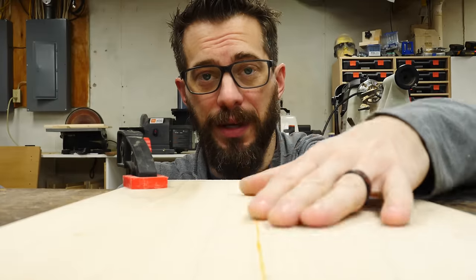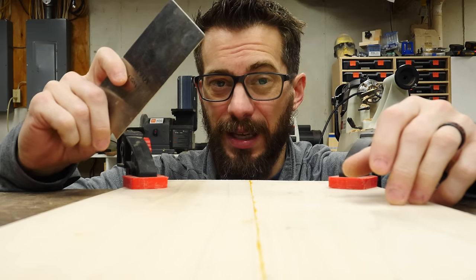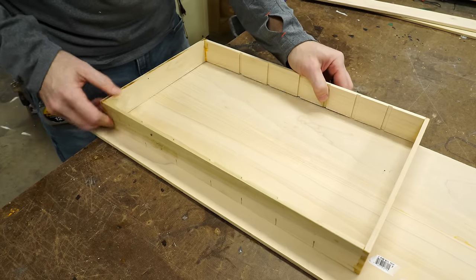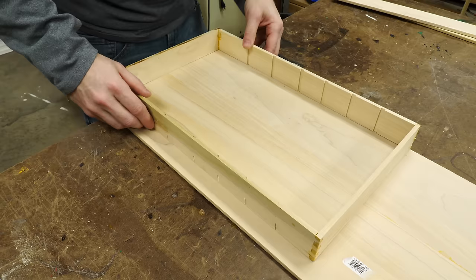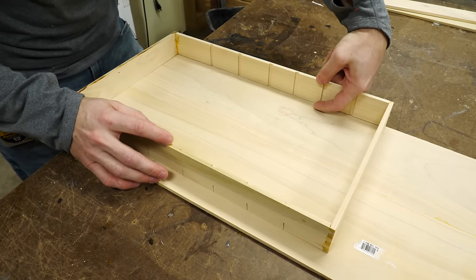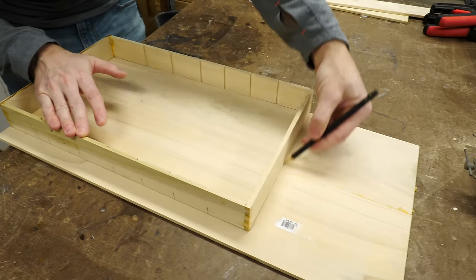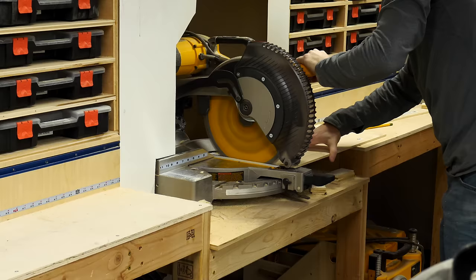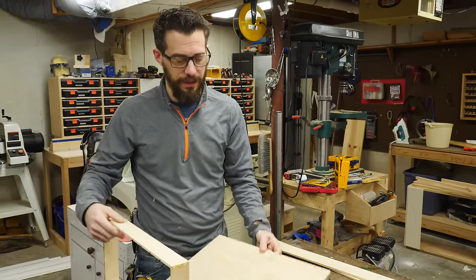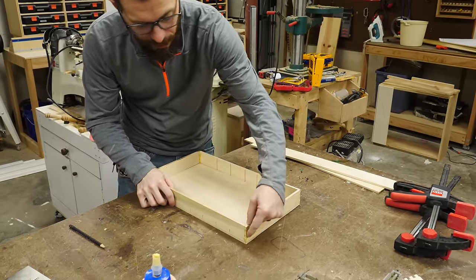If you've got a glue line you need to get rid of on a panel, you can use a big paint scraper, a sander, or a card scraper. The card scraper is something I've only recently started using and it's really handy with not a whole lot of dust. Now I'm just going to lay this tray on top of this piece and trace the outside. I didn't plan to put a dado or a rabbet on the inside of the bottom of this frame to inset that piece because I didn't want to lose the height — I need the height for all of the silverware to sit in. So this bottom piece is just going to be glued to the underside of this frame.